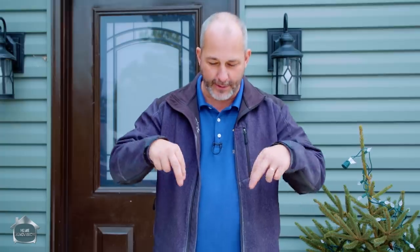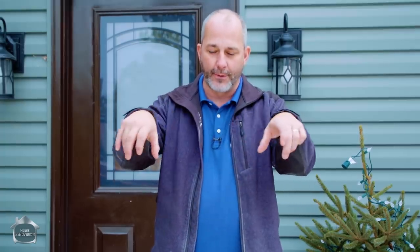If you're in the south and it's a warmer climate, then you can probably get away with just dropping in the rebar like you've seen in some other videos. But you might not need anything at all if you make it small enough. But the point is that if you're dealing with expansion and contraction in cold weather climates, make sure you use the mesh, okay? And even tie it together if you need to make sure that there's direction changes in the mesh in every part of the table. All right, mine didn't have any of that detail in and around the fire pit crack, and so that's why it damaged so easily.